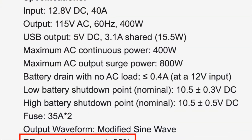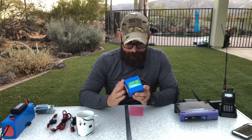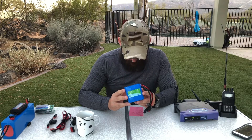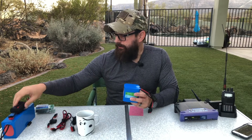That got me thinking - do I really need an inverter as part of my system? Starting with this small system I have right now, my short answer is probably not. The inverter I have is a very inexpensive 400-watt inverter and looking at the specifications, it only works at 85% efficiency. So based on the input coming in from the battery, I'm only getting 85% output AC. With this 4 amp-hour battery, at 85% efficiency - and that's maximum efficiency, so it's probably a lot less - I'm actually only getting 3.4 amp-hours out of this battery, losing 600 milliamps.